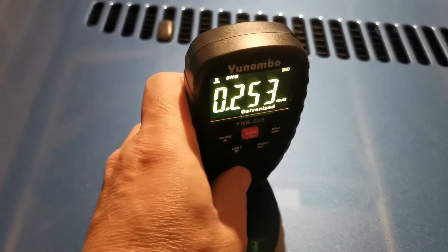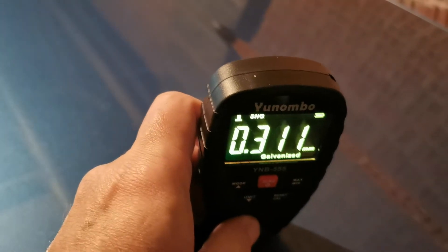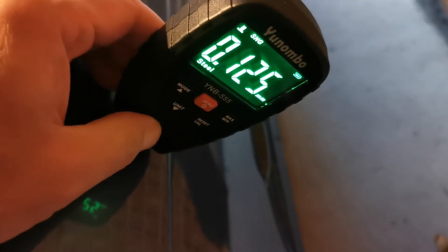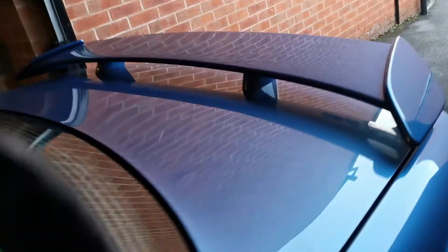How do you know if the lacquer is really thin here but not thin there? All you can do is take readings from all over and make estimated guesses. That's another 0.1 of a millimeter thicker there, but you can tell it's been repainted. This wing has been repainted - they did the whole front end to get rid of stone chips. This is a replacement wing; the other one had bubbling rust on it. You can see it's now saying steel, which is what I'd expect.